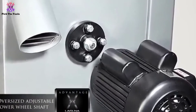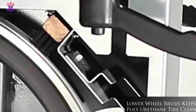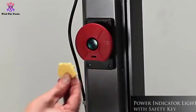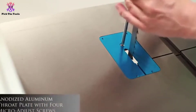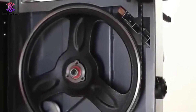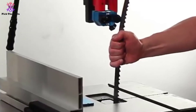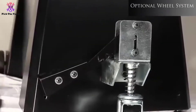The Laguna's table can tilt 45 degrees right and 7 degrees left, with automatic stop at 45 degrees. It includes an aluminum rip fence and cast iron work table and wheels. One potential downside is the small footprint — the narrow stand may not meet all expectations — but it suits frequent bandsaw users well. It allows for resawing 12 inches deep with a 115-inch long blade and 13-5/8-inch throat capacity.